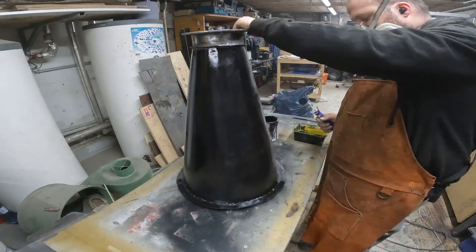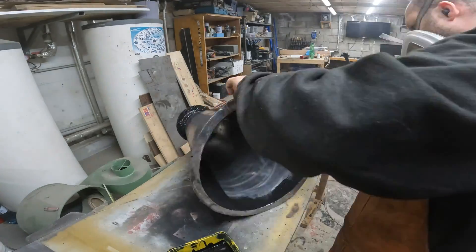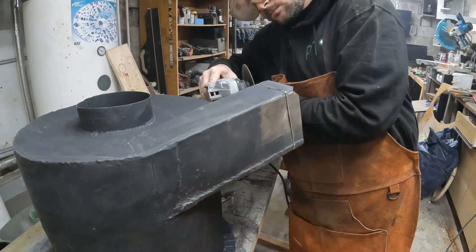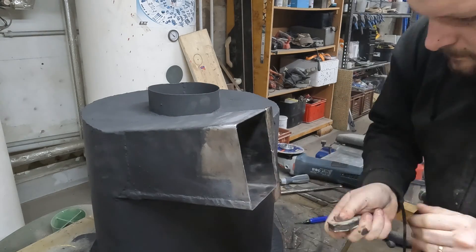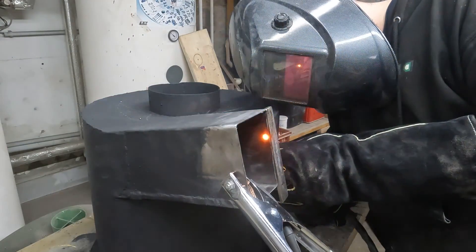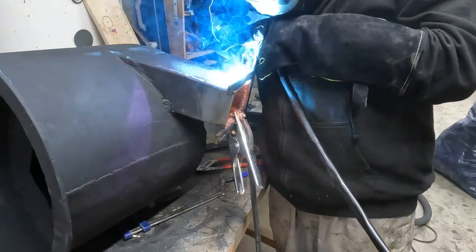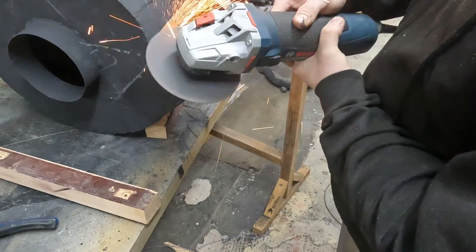Following completion of the lid, I turned my attention to the remaining parts of the cyclone. To ensure a consistent finish I applied a coat of metal primer to the entire structure, preparing it for the next steps. In order to mount a pipe on the square tube a connection option was still missing, so I decided to weld on a flange. During this phase of the project I made a crucial discovery about my welding technique — it turned out that the selected polarity on my welding machine was wrong. A rookie mistake but one with significant consequences. Additionally I had been using the wrong welding wire — a flux core wire which doesn't require shielded gas. Correcting these two errors improved the quality of my welds, making them much more presentable. Mistakes are part of the learning process, and it's important to adapt and overcome.